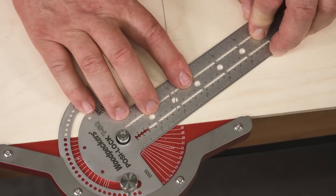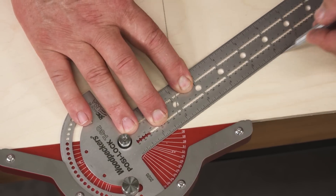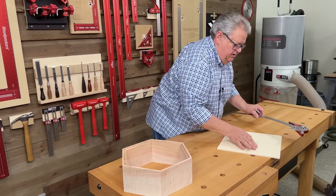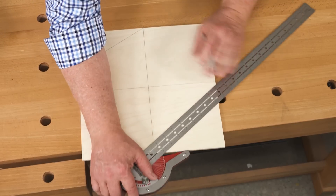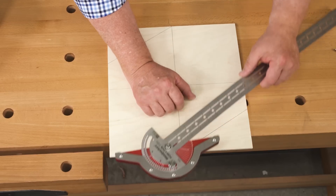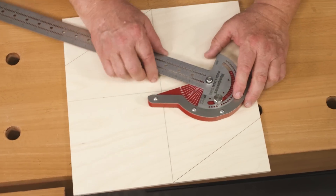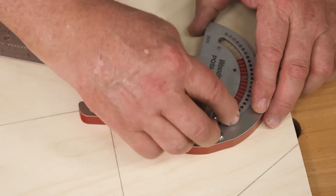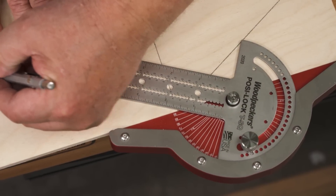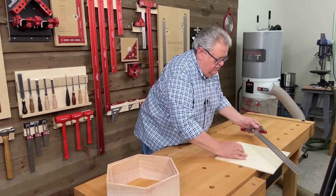There's our 30 degrees. I'm just going to bring the edge of the blade right to my pencil mark on the center point and mark that 30 degrees that way. Now I need to do the same thing on the opposite side — scribe. Now I need 30 degrees the other direction, so we'll just flip that around, go 30 the other way, lock it up, get to the center point, mark it, and do the same thing one more time.